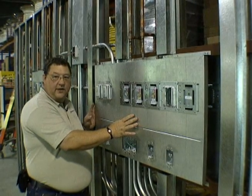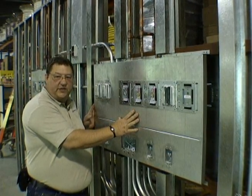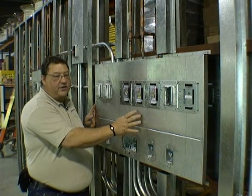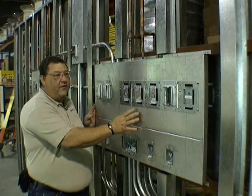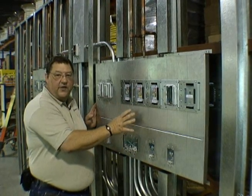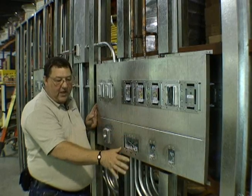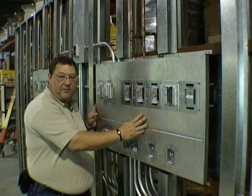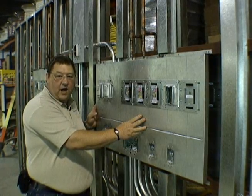What we will do in the production phase is we will build these sub-assemblies over on our production tables, bringing them over to our tilt wall table where they will be located with locator pins, so that this plate and every other plate goes into the same location every time, creating an exact replication for every wall.